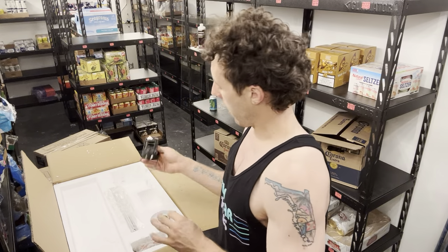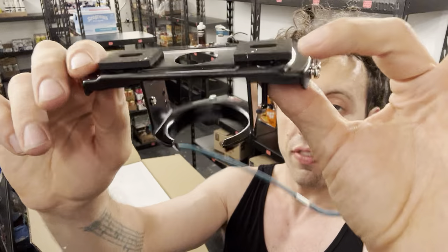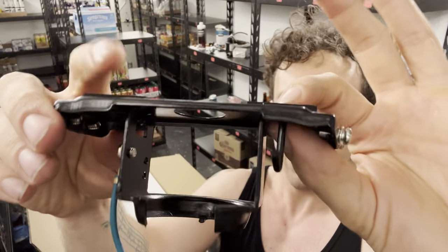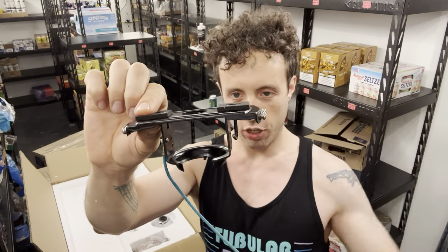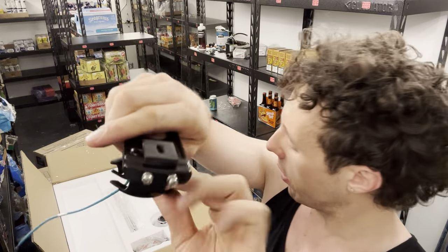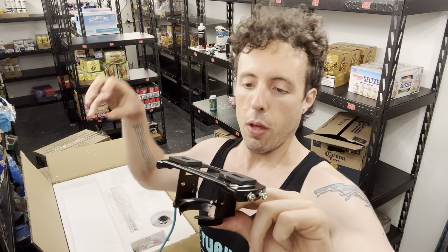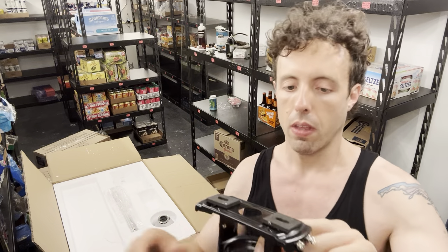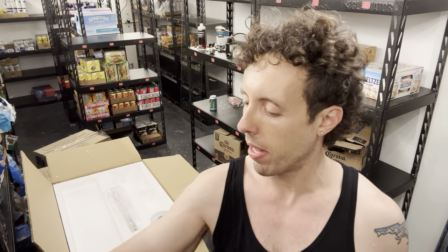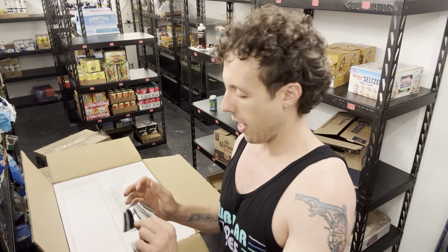Next up, we have the mounting bracket — a standard stamp steel mounting bracket with a grounding wire attached, and very thick, heavy duty noise isolation up top. One feature I was sure to include was this hook right here. If you're mounting without the down rod — flush mounting the fan where the canopy mounts directly into the top of the motor — you can hang your fan by the canopy, freeing up both hands to do the wiring, then mount the canopy to the bracket.